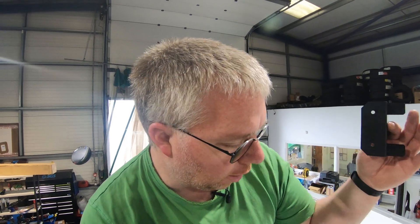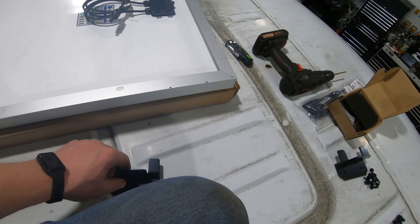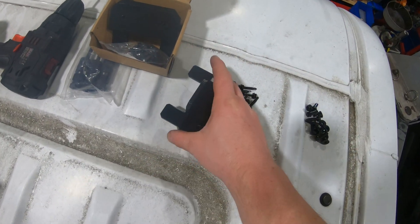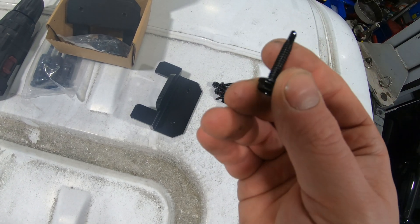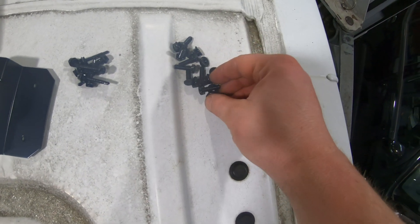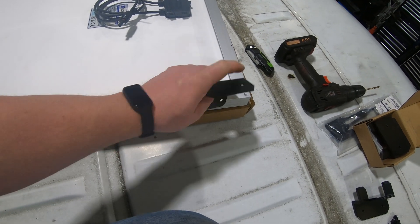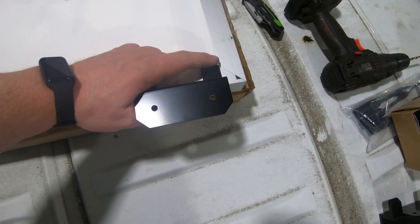The big plastic ones have a much bigger footprint and don't allow for these ribs, so they're better for flat roofs. We're going to go with these, and fitting them is pretty easy. We've got two holes here and we're going to drill two holes in the side of the solar panel in the aluminium edging. We've got four brackets per panel, self-tapping self-drilling screws that go through the bottom of the base into the roof with a layer of tiger seal, and nuts and bolts to secure the brackets to the aluminium panel. I'm going to line them up with the corner on all four corners on both panels.